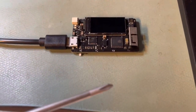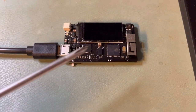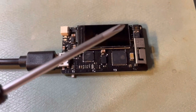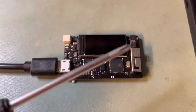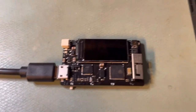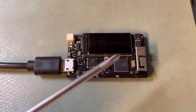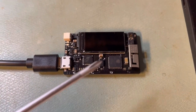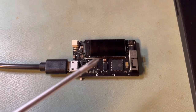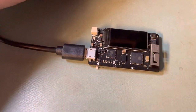What it has is the coin cell board. I'm not using the sensors up here — the accelerometer or the humidity temperature sensor. I'm not using the battery or any of the charging circuits. The only parts I'm using are the Wi-Fi chip, the display, and the time-of-flight sensor, which has a sensing distance of maybe two feet or so. I have it set for one foot, so I'm just going to plug it in here.